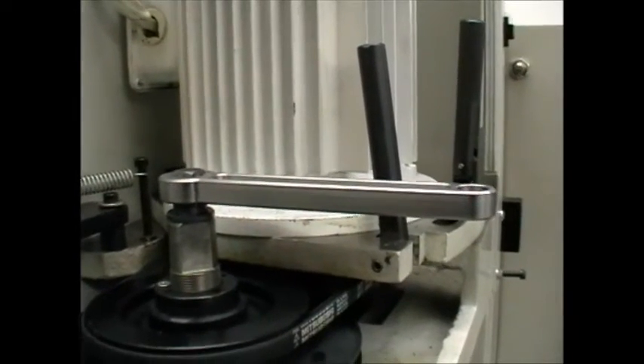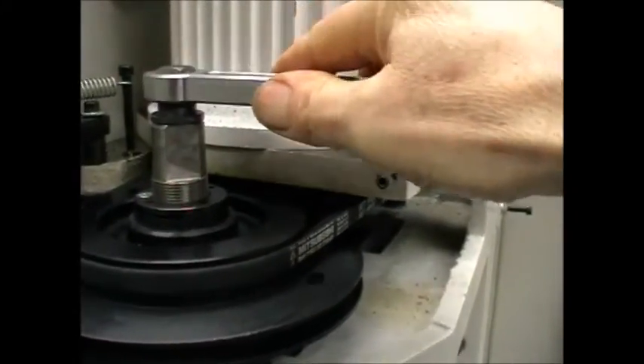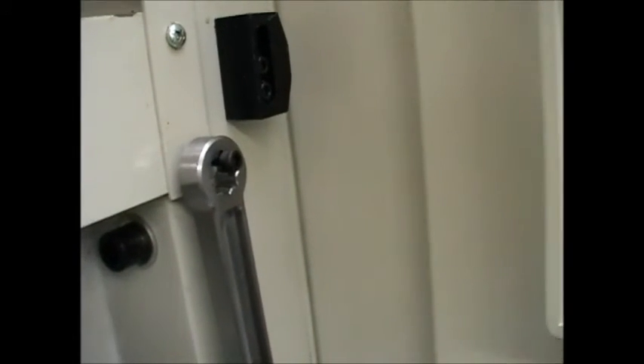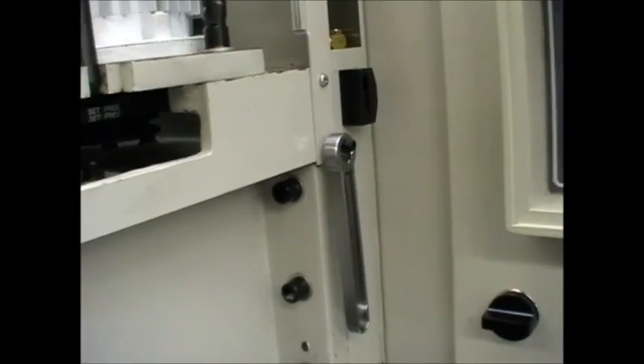There we are — two octagonal ring spanners all done. Hopefully no more wear now on my drawbar. There's a handy location, a little screw that you can remove — a 5mm metric screw — and put in a longer cap screw, just a convenient place to hang it so you're never out of reach. It speeds up the tool change process a little bit.